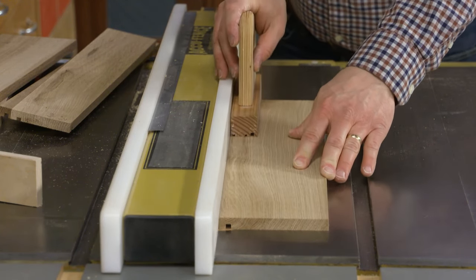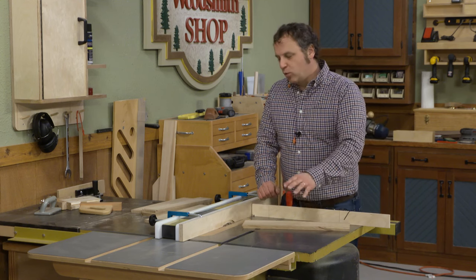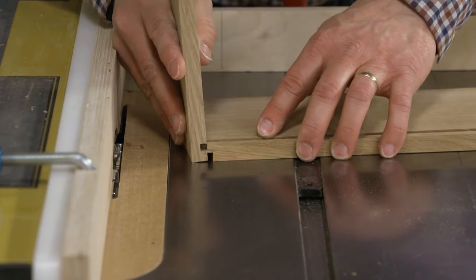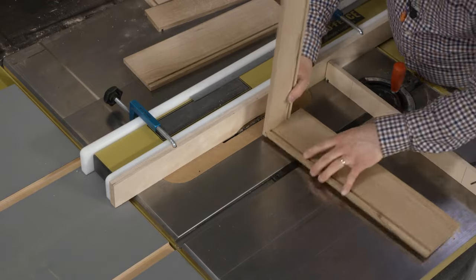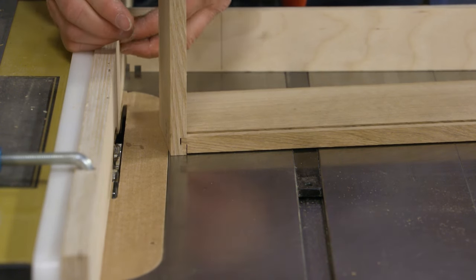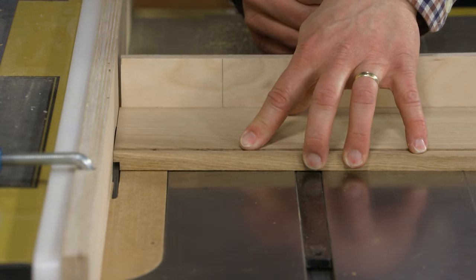The other half of the joint is forming a tongue on the ends of the two end pieces to fit into that dado. You're going to work right off the workpiece and the existing dado to dial it in — rulers and measurements aren't really going to help. What you're looking for is a nice press fit into the dado. It's a little tight but we're getting there; I want it to bottom out in the dado as much as possible. Adjust the rip fence for tongue length and the dado blade height to dial in the fit.